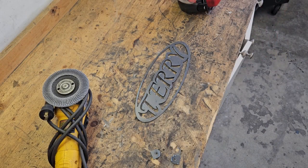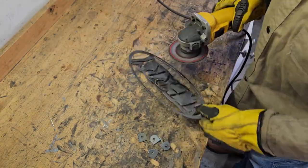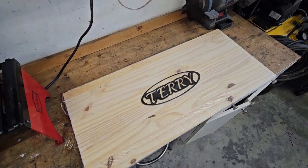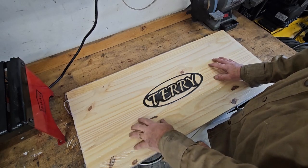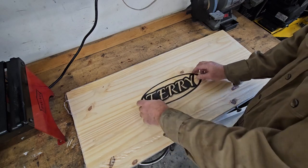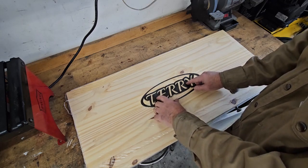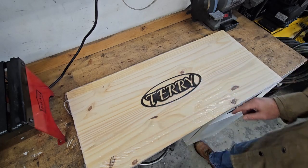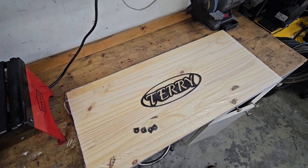There's the name cutout and the tombstones — let's get them cleaned up. Just as a preview of what I'm thinking: this is a box-store 1-by-16-by-36, so 3 feet — it's going to be the bench seat. This is what I cut out and it's going to sit on here. It's got a little bit of an oil can to it, but when I attach it, it'll be fine. The tombstones — no one's going to see those, but they go on the bottom of the frame to attach the bottom shelf for shoes.